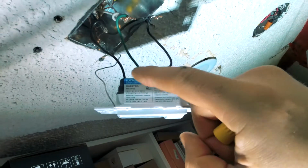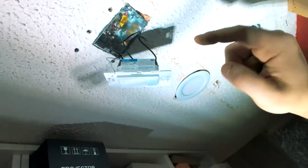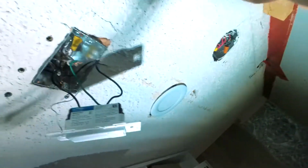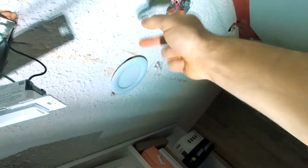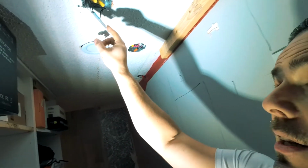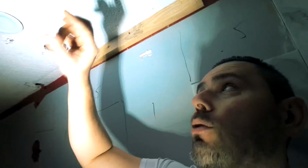This is a Maestro Lutron MSOPS2. And this is an occupancy light switch. Because this pot light is being connected down to this pot light, we're really only hooking up one pot light. And then that pot light is continuing the circuit and passing the electricity to the second pot light. This light switch is hooked up incorrectly, meaning that it does turn on, there's power going to it, but it's not actually allowing the circuit to finish and transfer the power over to the pot lights.